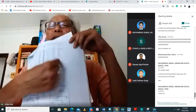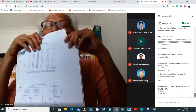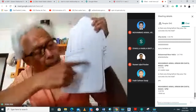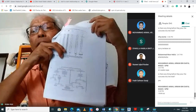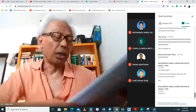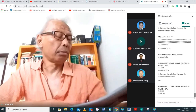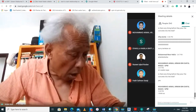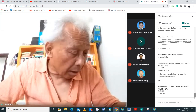If I'm going to just have a hole in the ground, then I'm going to put concrete and reinforcement, with or without, then I have very little displacement. Okay. So the bottom part is what British Standard 8004 is saying to you about small displacement, large displacement, and no displacement. If you can read that, the types of pile say preformed, solid, or something. I can read that. Driven into the ground.